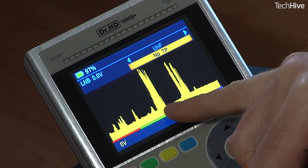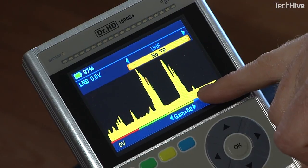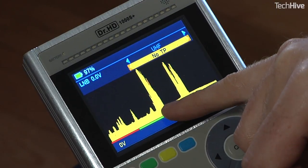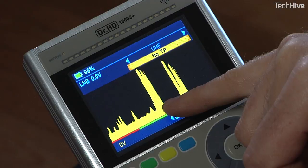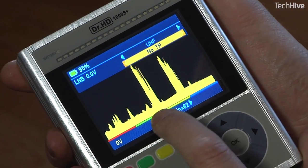This stuff up here is not TV, and you can see there are two very strong transmissions which are probably very local to me, and also some stuff bouncing up and down which could be things like emergency service radios. The worry is that these signals are so strong that some will bleed in and the tuner will have trouble getting rid of it all, affecting your TV reception. An LTE filter should get rid of everything.